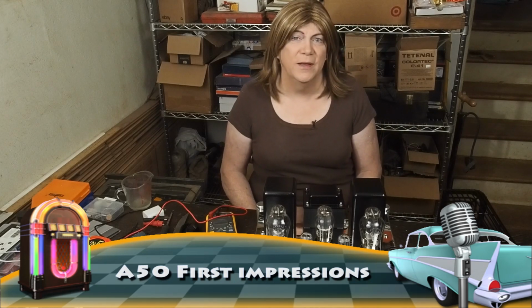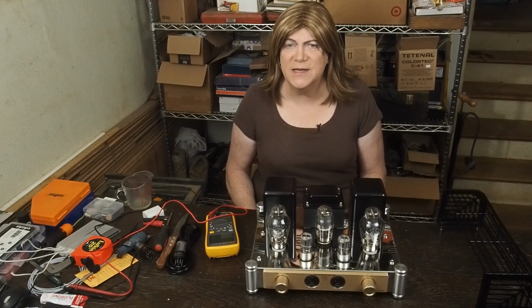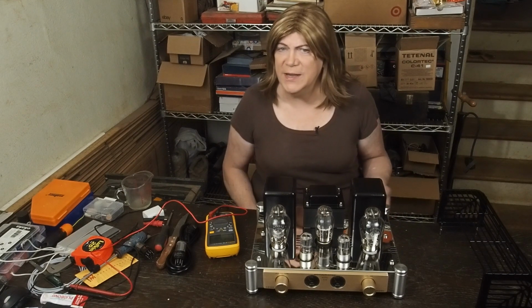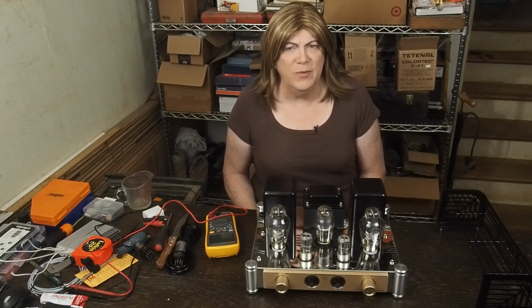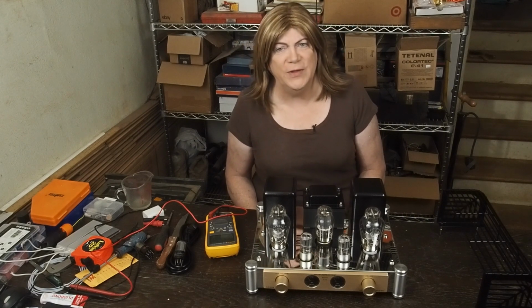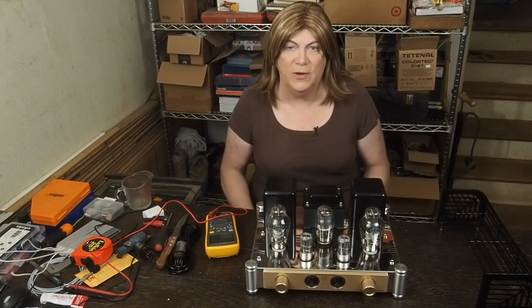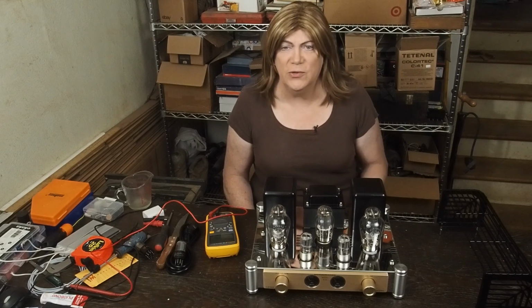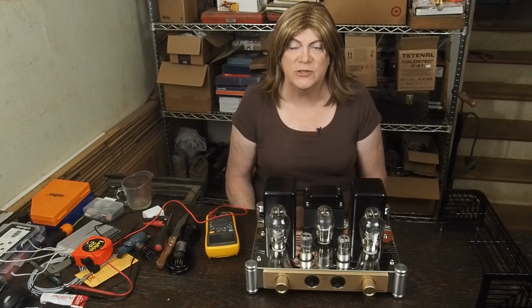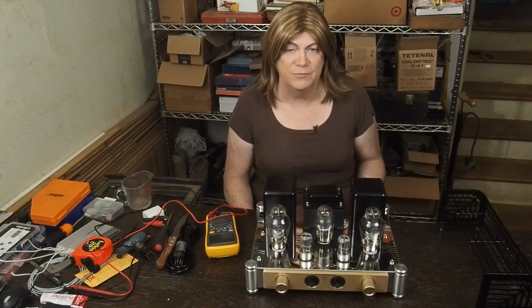Hi everyone, I'm going to do a short video about my first impressions listening to the Boyuurange A50 300B amp. As I'm going to cover in another video, it seems to be calibrated for 120 volts. The filament voltages all came out spot on, running it straight out of line voltage at my house. I pulled it up on a variac to make sure.